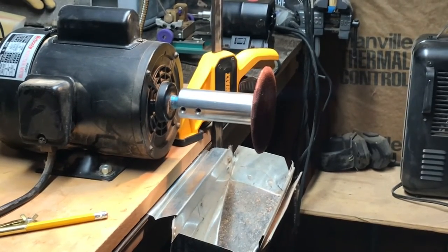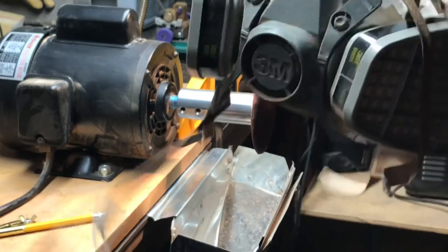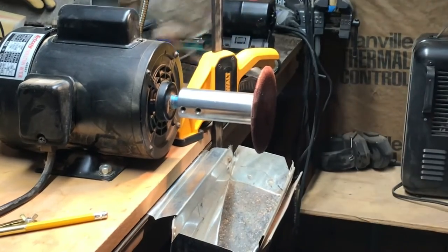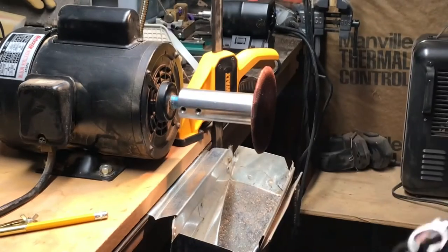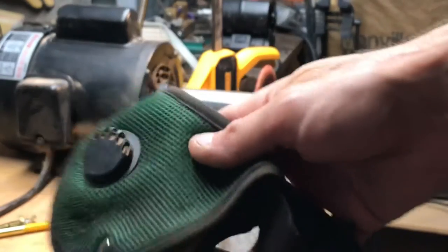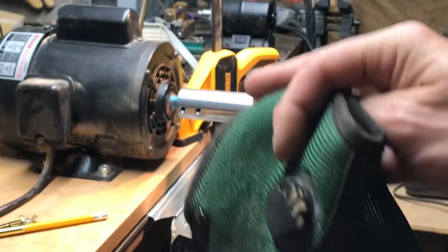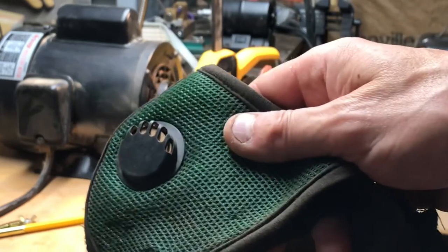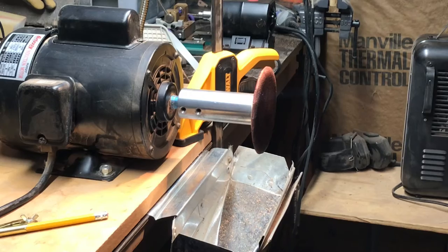And of course, whenever you're working with briar or any kind of woods, you want safety glasses and a good filtration system or a good dust mask. This is actually a really good 3M one. I have experimented with some lower cost ones like RZ masks. These were big for a while. Here's the RZ mask. I was using this RZ mask after working on stems and wood, where I have fine dust, and I would have dust caked on my face inside the mask. It's a really cool idea, and it may be good for certain applications, but if you're doing a lot of woodwork, I would go with a high quality 3M mask.